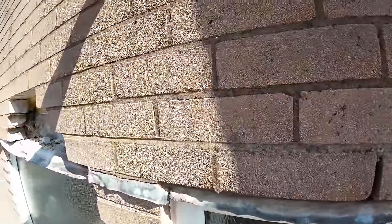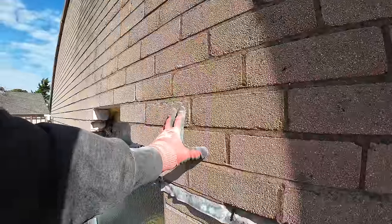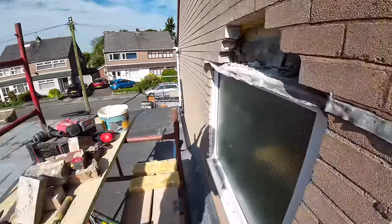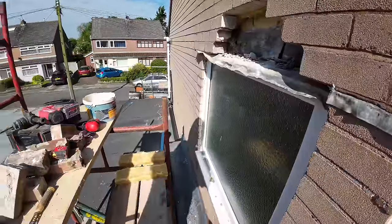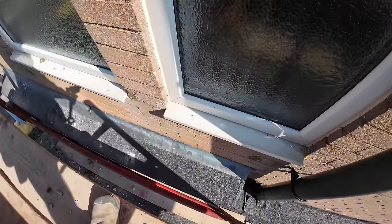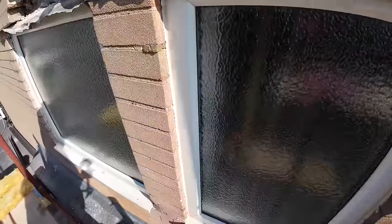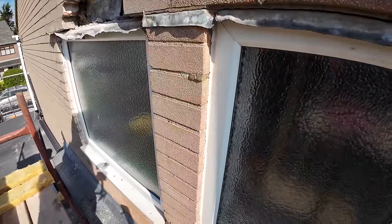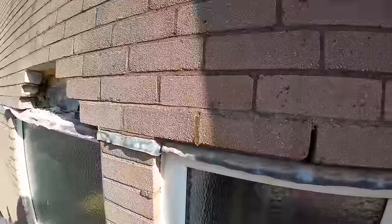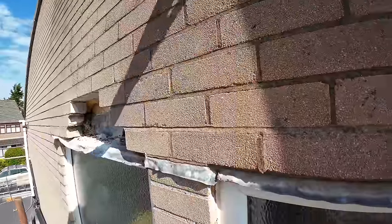And we're way behind today, probably get after 9:30 now. The last couple of jobs we've almost had this out for 10 o'clock, but we're up on the roof and it's a lot more awkward setting the scaffold up. We've had to pick up the small acros because you can see that box is in the way, whatever that is. Must be something boxing the drains in. And we've had to swap one of the lintels because I got a 2.1 for this and the opening is 2.1. So obviously you do need the seating for a lintel. So we picked up the 2.4.